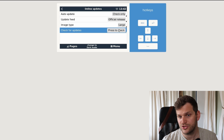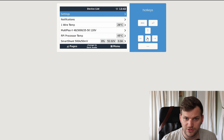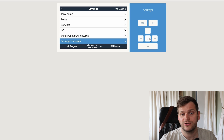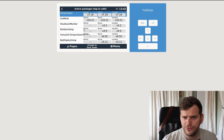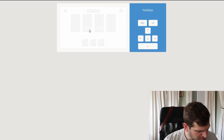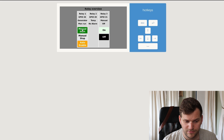Let's go to online updates — pressing check — no newer version available. Good. Going back to the menu, scrolling down: we have one-wire connected, the MultiPlus, the Raspberry Pi processor temperature, and the SmartShunt. Everything that should be here is here. Going to settings, then to the package manager all the way to the bottom — the setup helper is already installed and checking for updates. Let me go to pages quickly. I can see the MultiPlus. I can trigger it here. Turning it on — it just kicked on. I can see and hear my relay. It does work.